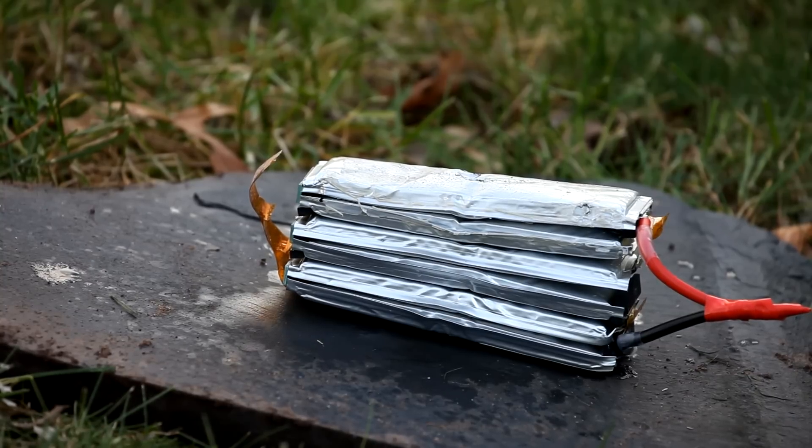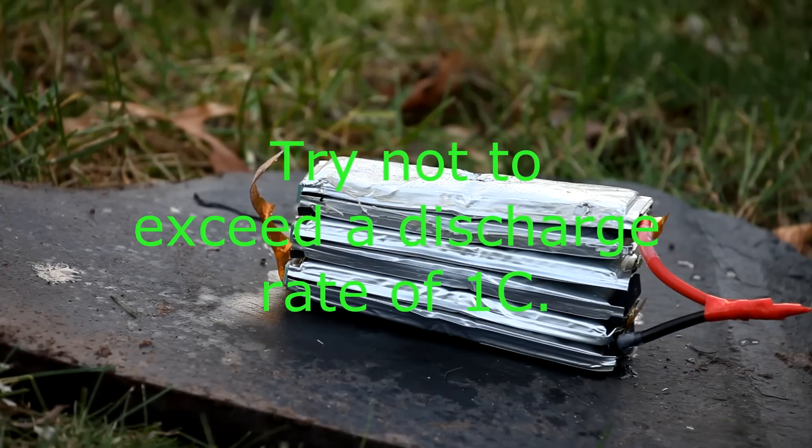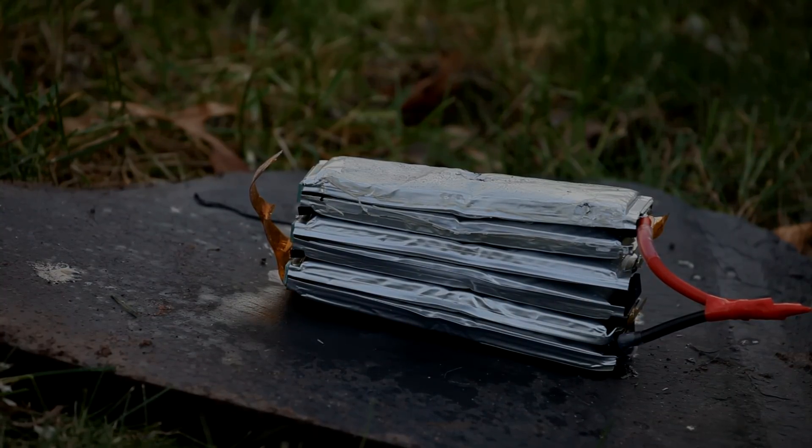My recommendation: I'm definitely using the resistive method. Either invest in a resistive load tester for batteries, or rig up your own artificial load via a car headlight or two hooked in series, or some other large wattage resistor. The resistive method is definitely cleaner and gets the pack down to zero reactivity to puncturing. The brine solution for a pack that has any kind of charge in it is not a viable solution. And if you're going to discharge a pack to zero and then put it in a brine solution, that's just an extra wasted step — plus you've got the mess of what's left in the brine to contend with.